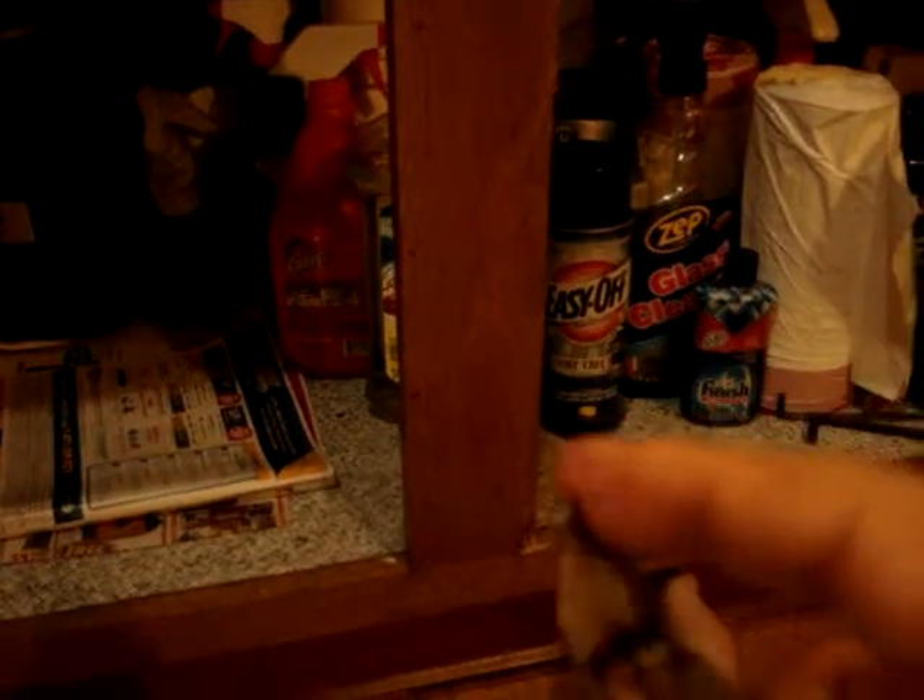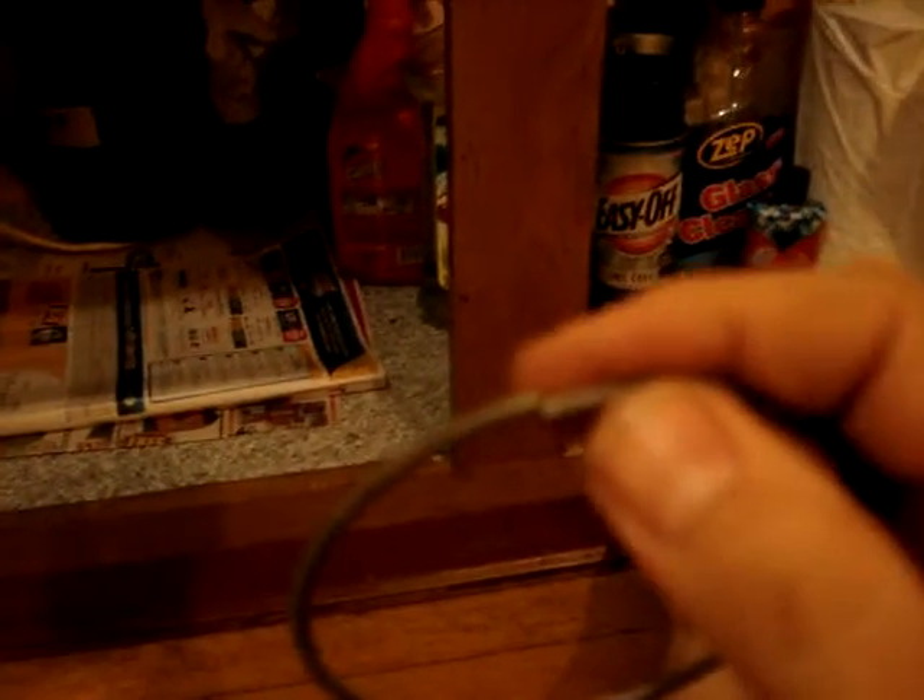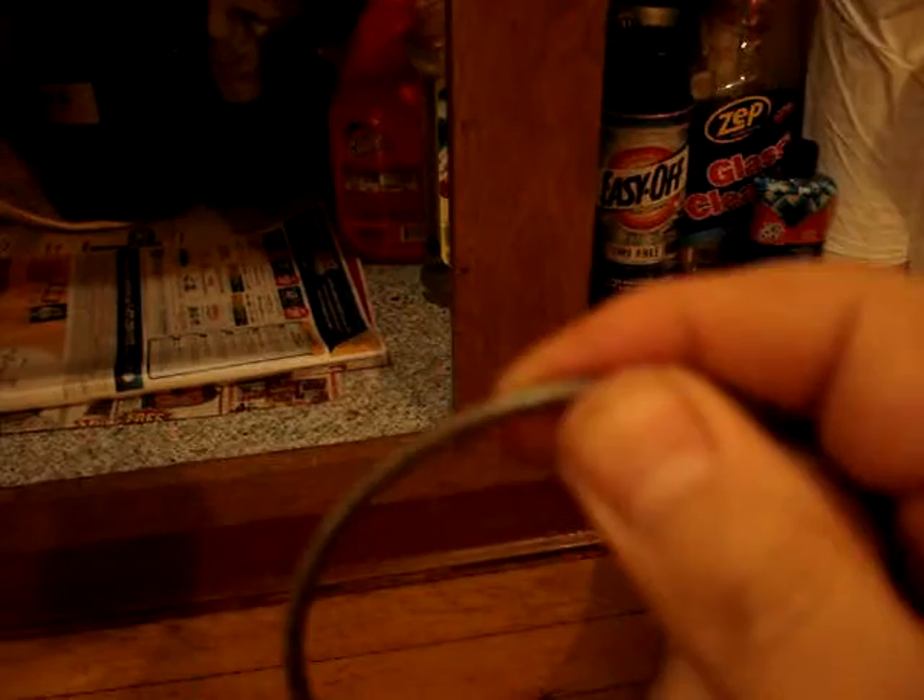They're not a big deal, you just gotta be aware of them. The old-style sink strainers have this tough metal piece around them. You have to use the sharp end of a tool to get it off — there's a little space they leave in there where you can get your tool in. You want to take this large washer off. That's how you unscrew the old-style sink strainers.